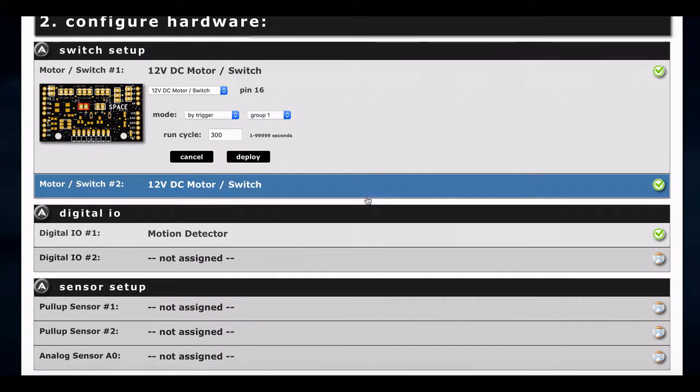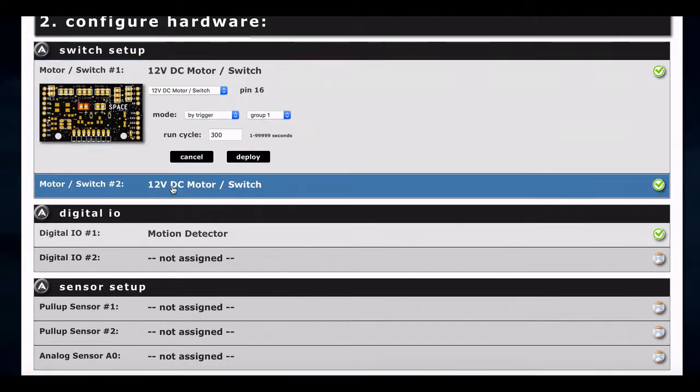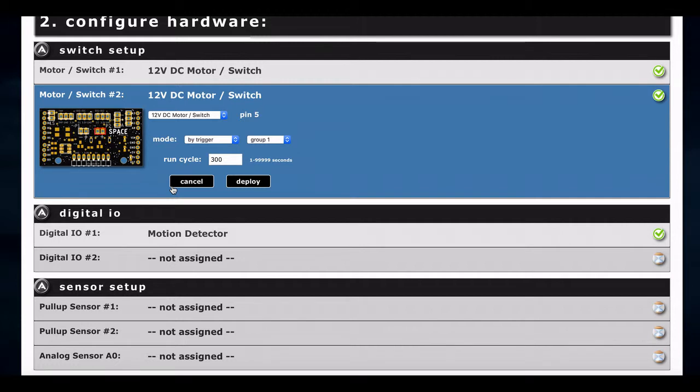So you've got your 2 lights, LED strips, so you can use single or dual LED strips, so you can have 4 LED strips running total. And you can wire up your own and probably get 8 if you wanted to. Each one of these LED strips we ship runs about, I think, 80 milliamps or so, and this channel can support about 500, so you can run about 4 per channel.